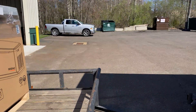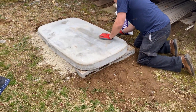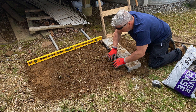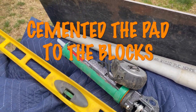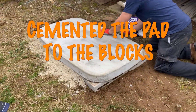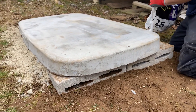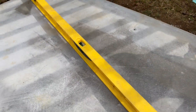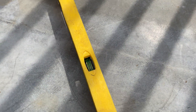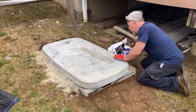Leveling the pad is extremely important. Doug is setting up a pad right now — we do what we have to do to level the pad, and in this case we have to add concrete blocks, which we then glue to the gen pad. Basically those two concrete blocks underneath it become one, and the pad is completely leveled in all departments.